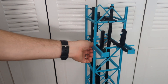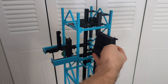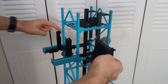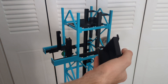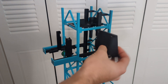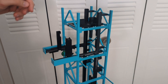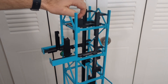One of the mechanics I was hoping would work out was using a ramp to redirect the cabin into the transfer position — it would lift up a little bit, then drop onto a little ramp inside the tower track to push it forward. That's actually how the real-life ride works. But I just don't think it's going to work very well, because there are some minor bumps, and these things weigh approximately nothing. These cabins don't have very much momentum, so any little bump and they're going to get stuck.